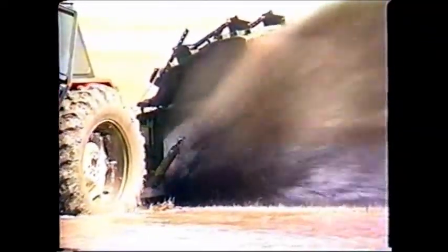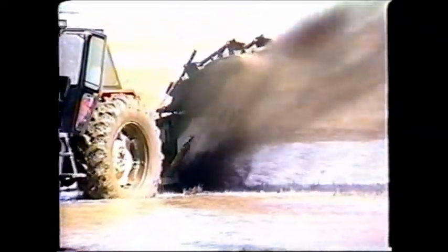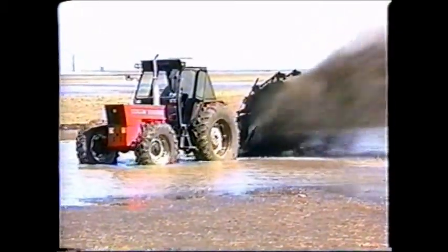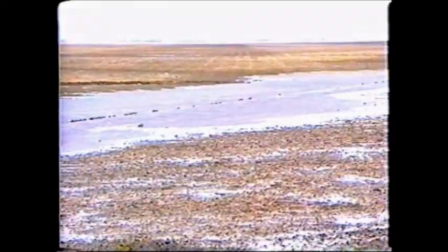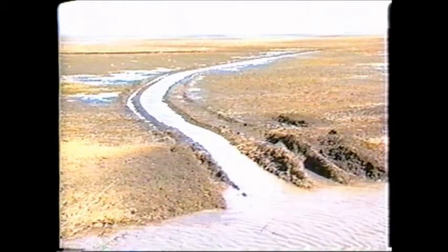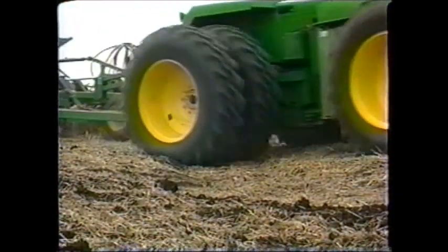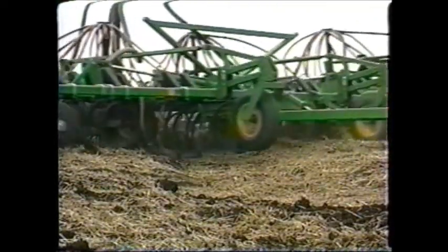In the spring of the year, the ditcher is mainly used to drain wet areas, potholes, and to facilitate the complete flow of water from the field to allow seeding to begin. In this situation, it's usually unnecessary to construct deep and permanent waterways. The draining of the field to allow seeding to begin will be the priority. Just 2 hours after this single drain is made, the field looks completely different. These shallow ditches can easily be crossed once the field has dried up.